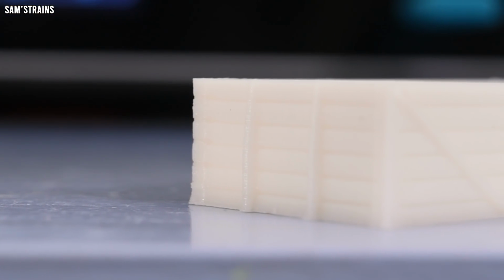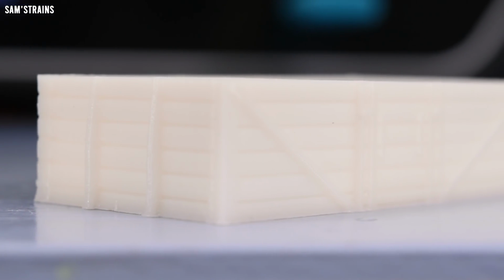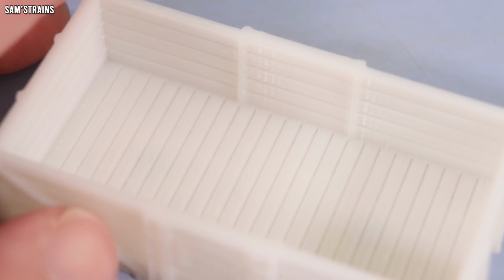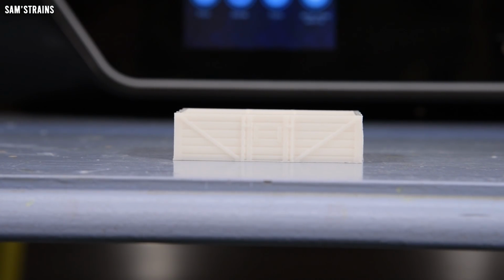And get this, I did not have the jerk and acceleration controls enabled for this print. I forgot to enable them, and even so, I mean, the actual fidelity and the accuracy in the print here is 100%. I cannot see any imperfections in it whatsoever. Don't get me wrong though, even though the acceleration and the jerk do cause print times to increase a little bit, it's well worth having those enabled, if for no other reason than just to reduce the amount of force on the machine itself. Yeah, it's a good idea to have that enabled.